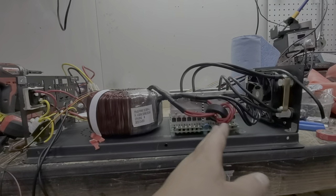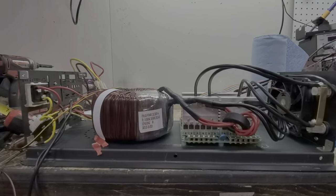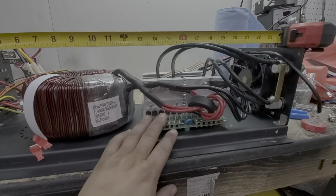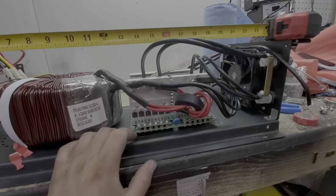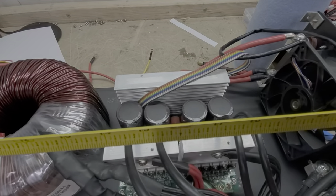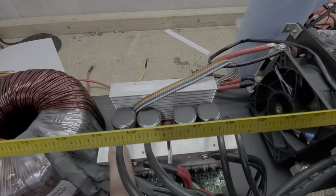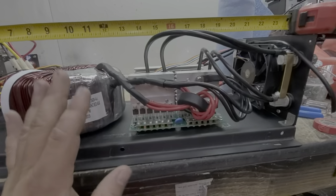This inverter is 60 centimeters — this is the 8 kilowatt version with a 10.3 base, rear, and front. For us in the States, that's almost 2 feet long, just shy of 2 feet. This is the actual main board we're going to be using. It will have a total of 4 caps — four 100-volt, 10,000 microfarad caps. We're going to be using these same caps and MOSFETs across all our inverter lines, from 12 volts to 48 volts.